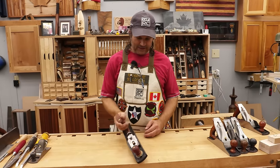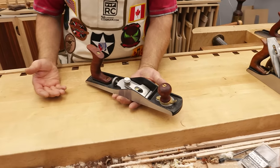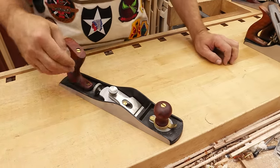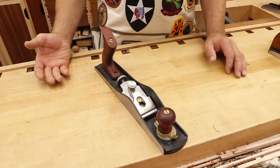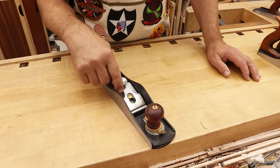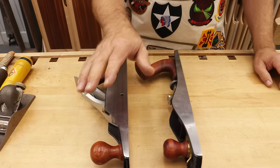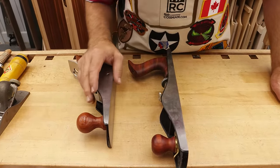The next tool, staying on planes, is a low-angle jack. It's a remake of the number 62 originally done by Stanley. There weren't very many of them around because they weren't terribly popular. I don't like this plane at all. I don't like the fact that the adjuster knob is down underneath — it's very awkward to move. I use my jack on my shooting board a lot, and while a lot of folks talk about this being great because of the low-angle approach, you just don't have a lot of surface area. Compare that to the five and a half, which has far more surface area for stability on the shooting board, and a lot more weight.